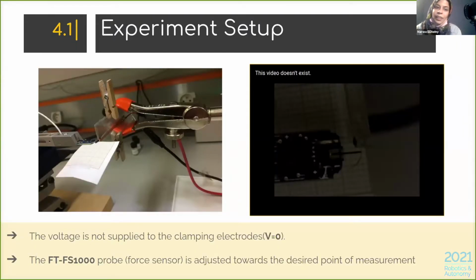So as you can see, it's quite challenging to feel how we can do this characterization. When we apply the force, what kind of test do we want to see? One of the tests is called the block force. We clamp the sample, and clamping is so important when it comes to soft material. It's so important that we do this characterization properly. So what we do here, we have to measure the block force and displacement for the sample.